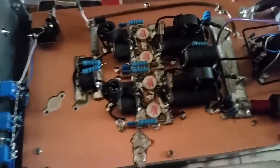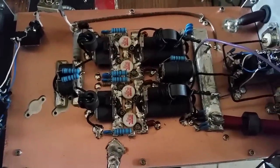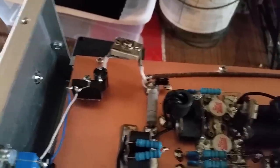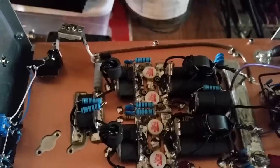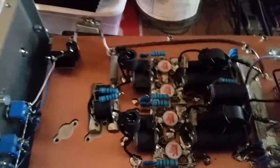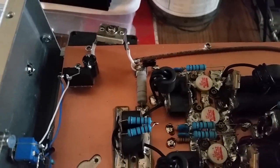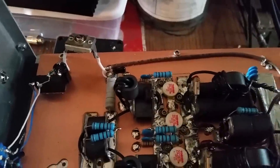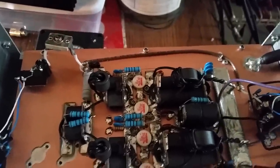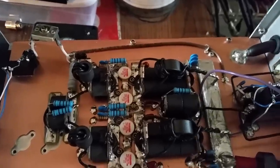So this is a clean little straight forward high-drive 2879, Class C. It's got a sideband delay — went ahead and utilized a relay there. Basically what that does is when you add a regular 1000 to the relay — the fat boy has figured this out as well, I actually figured it out by accident — but it makes it where you can talk sideband just fine, but with just a regular 1000 the delay is kind of short. Something about the ohms of the coil of the relay along with the 1000 gives it a much better feel, a lot longer delay — absolutely beautiful.